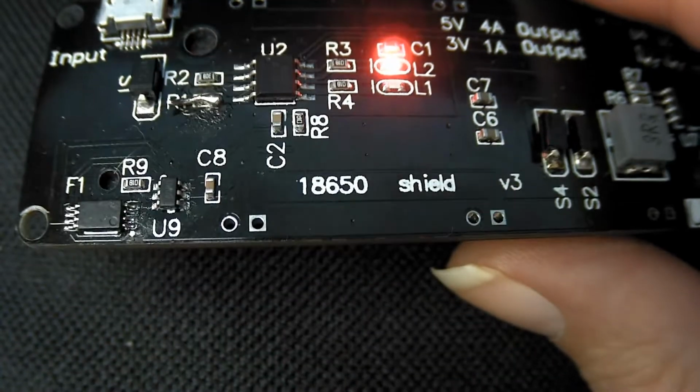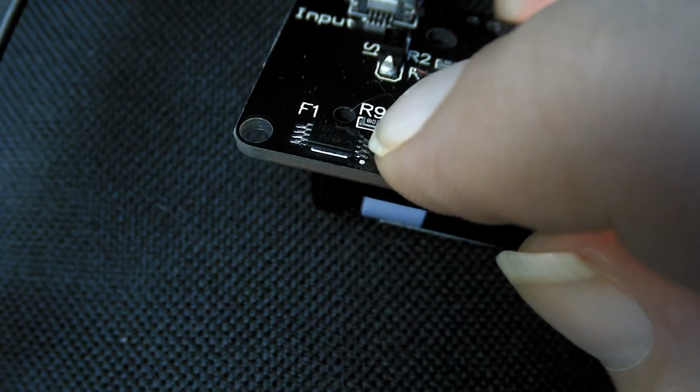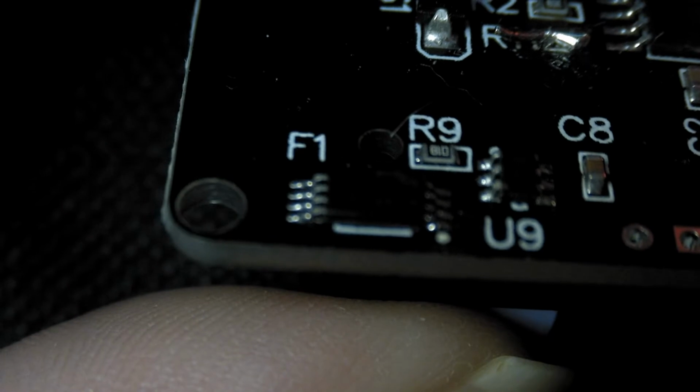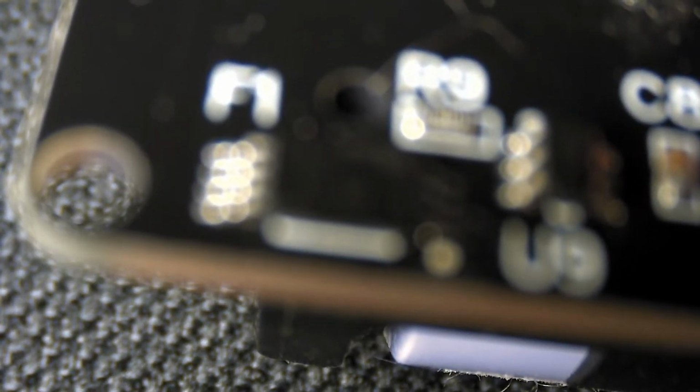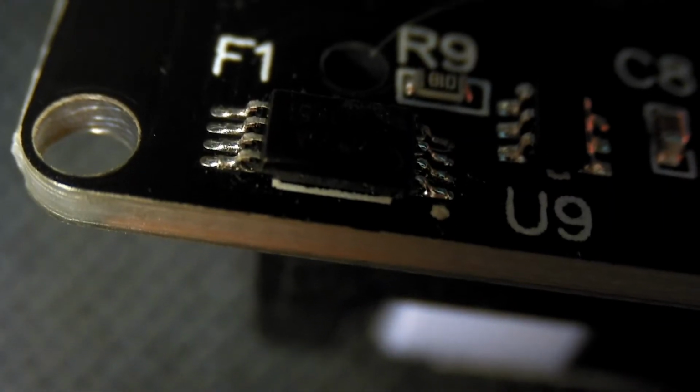And anyway, basically there were some dry legs right there. And in fact, these still look bad. I didn't touch up all of these, and it was a giant pain because my fuse blew on my air workstation. Actually, it didn't blow, it deteriorated, on my air rework station. So I couldn't conveniently work on this thing. I had to do it with an iron, which is fine. It's just between my old eyes, and actually those don't look as bad as I thought. Maybe I did touch those up.